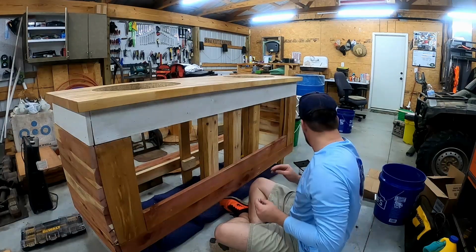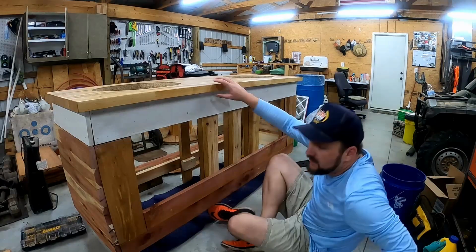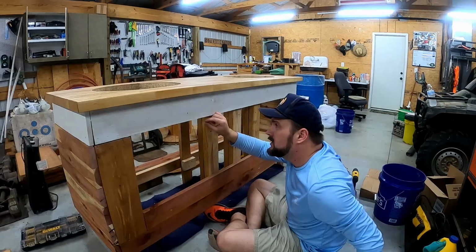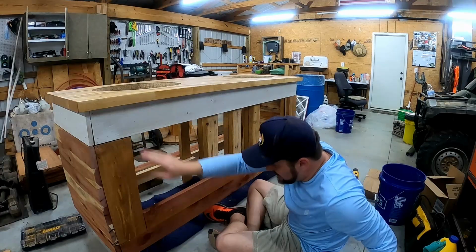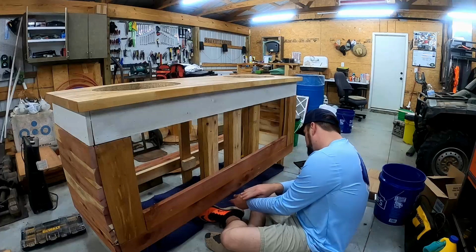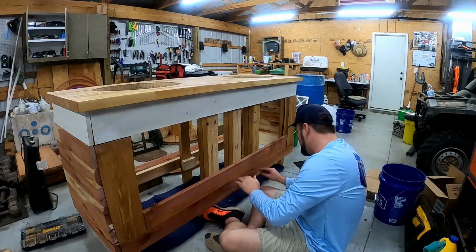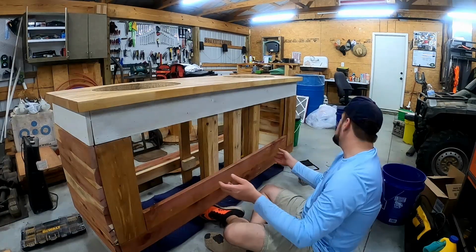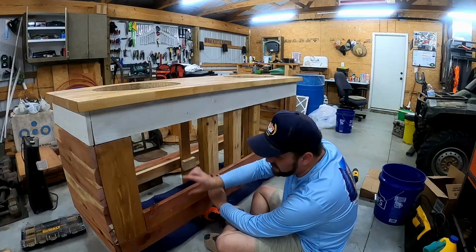This is where you get like a screw or a nail. I might even get a nail, and we're gonna gap all of these and make it fit. So I cut them. This gap over here was 19. This was like 18 and 3/4 because this bottom board here is bowed a little bit. This was like 18 and just shy of over a half. 18 and 3/4. So we're gonna gap these with little nails, and I cut the width of all five of those boards to like 18 and a half.